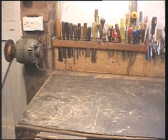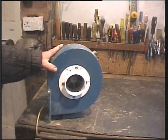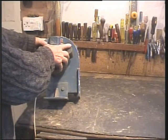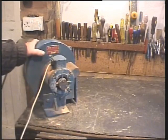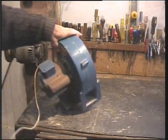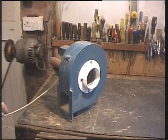Anyway, that's out of the way, not using a shop vac. Oh, I've got this, which is a blower. That's about 4, 4.5 inches. It's a centrifugal blower made by Bob, B.O.B. Fans Limited, Coleman Street, Derby. It's only a small motor. Well, it's 1.6 amps, so it's very little. It's about a third of a horsepower, I guess. But it shifts a phenomenal amount of air.